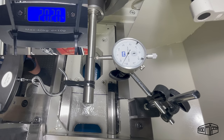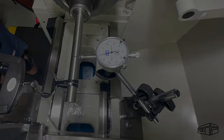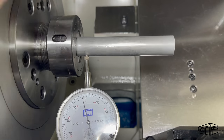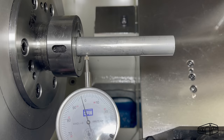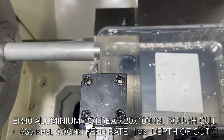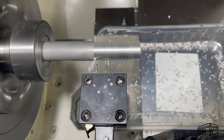The same observation on the 5C chuck yielded slightly less deflection. The real measurement is on the performance of the collet during work. I've set up a length of 20mm 2011 aluminium bar stock and I'll machine a 100mm length then measure the diameter at each end. The lathe is running at 635rpm with a feed rate of 0.06mm per rev and a cutting depth of 1mm. I'm using a high speed steel tool bit and this is a roughing cut, not a fine finishing cut.